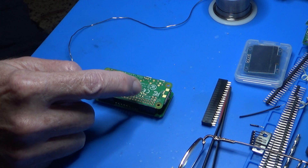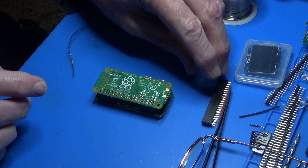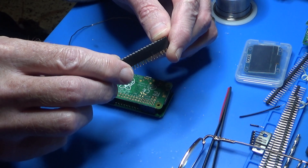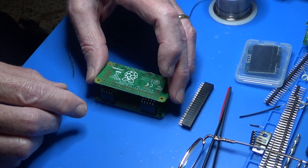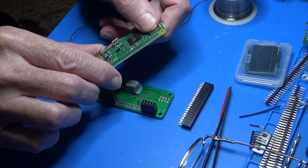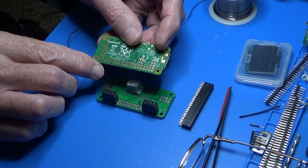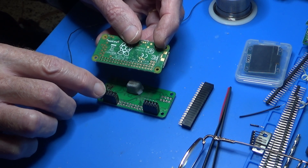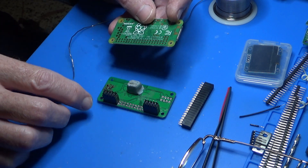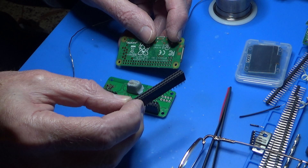There's 2x5, 2x5, so you've got 20 pins all up. If you're soldering a full-length header, then you might want to consider getting yourself a full-length socket. The reason I say that is, if you're soldering the header pins to here just on their own — so they weren't in a socket, they were just loaded in, the board was upside down on the bench — there's a fair chance during the heat process that you're going to move these pins within the header itself. The pins will move in or out depending on the pressure that's on them, so I always recommend that you load the pins into something.